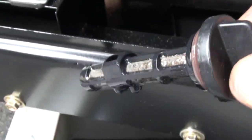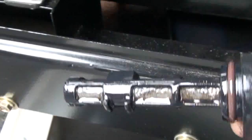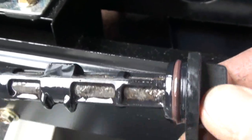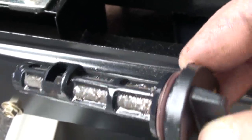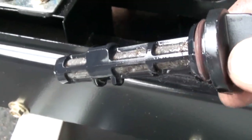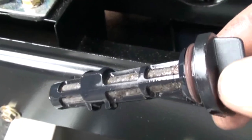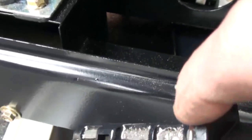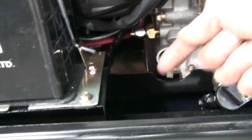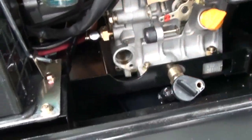A lot of generators this size on the market won't have any oil filter or oil pump — they're just splash-oiled, where the crankshaft splashes oil around the inside of the engine. But this one has an oil pump, and because of that they were able to put this filter screen in to trap all the metal shavings. Any lesser generator would have had those shavings circulating and causing even more wear. We're going to clean this out with carburetor cleaner or WD-40, then reinstall it. The engine is tilted slightly to help drain all the oil out front.